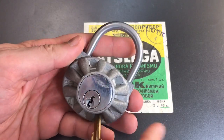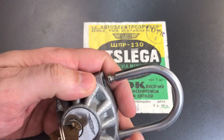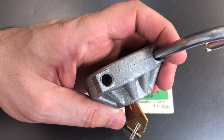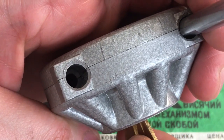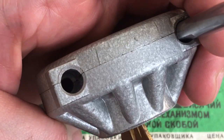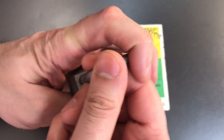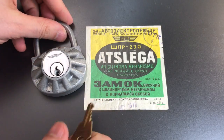The locking mechanism is something that is not strange but certainly not common either. We have a small notch that's machined out of the end of the shackle. And then if we look deep down in that shackle hole we can see a small bolt that slides in from the side to trap the end of the shackle. So assuming that bolt is not too thin — and it's hard to tell just by looking down there — it's probably a pretty robust design and certainly one that can't be shimmed very easily.